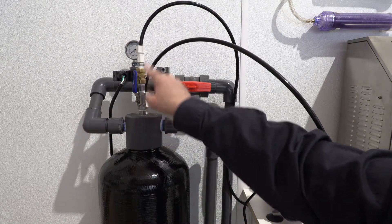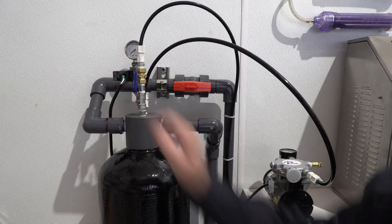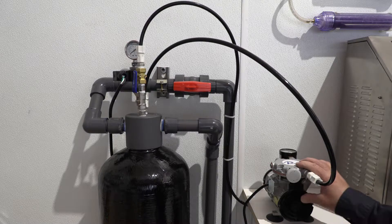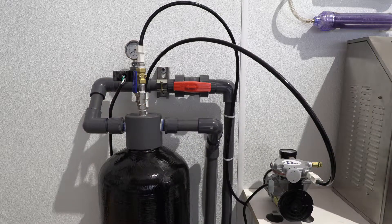You've got a ball valve and solenoid valve that goes out to drain. This system comes in two different varieties. The demonstration today we're going to have the pump and the solenoid valve hooked up to a timer — you can set the timer to come on several times a day to give you fresh air into your tank for odors. The other way is to hook it up to your well switch. We also have a 220-volt version where the pump and solenoid valve can be wired directly to your pump.